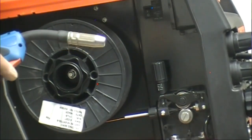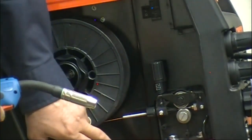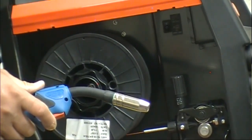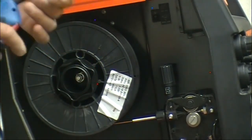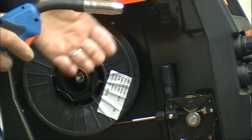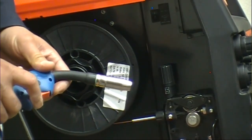A few things to explain about the HP 2000: if you have the switch set to the spool gun and you push the trigger, the driver is not going to make contact but it won't turn. You need to push the drive so it connects to the drive motor. Now when you push the trigger it starts feeding the wire. This unit has a special device — if the trigger is pushed but it's not welding, the system shuts off. It's a safety feature in case somebody left the gun on.